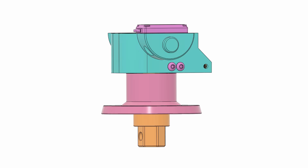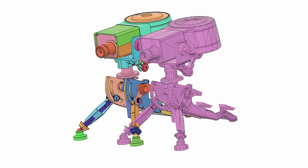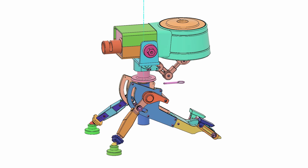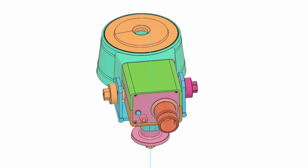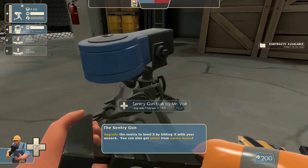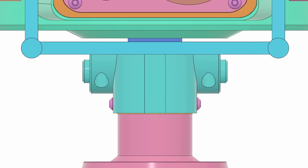Before we move on to the rest of the design, you might have noticed that this next piece looks a little weird. I did my best to stick to the proportions and features found in the original game design, only adjusting slight features to reduce cost and make assembly easier. One key element I tried to preserve was a lack of visible wires. This meant that all of the motors and electronics would need to be housed in the upper turret. But this presents a real problem: if the sentry is going to swivel along this axis, then whatever motor drives the mechanism needs to be mounted downward. The game model here is just a large hinge, but since the sentry doesn't tilt at this point, I ignored it and managed to stuff a servo right here.